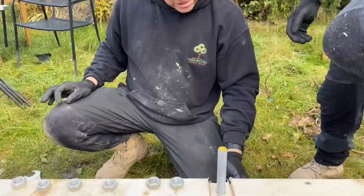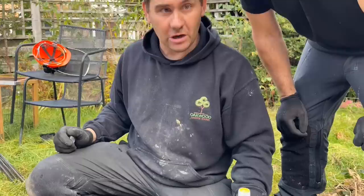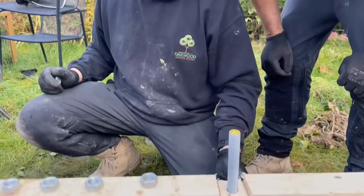Come here, mate. What am I looking at, John? Just come to me. I'd like to give you a little tip. When you put these nuts on, what I'd always do is have a little wiggle of your shoe. And when you tighten your nut, your shoe shouldn't be able to move. We have had it on rare occasions with new joiners where the floor's looked not quite right, and when I've gone like that, the shoe's wobbled, even though the nut's been tight. Just a little tip.